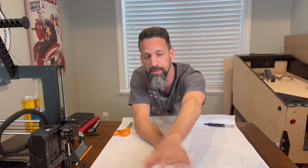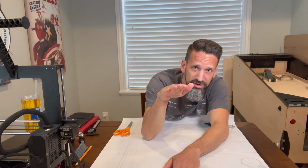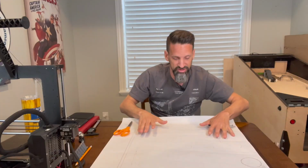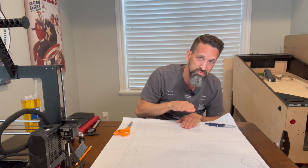The other good thing about that upper third is where you have the most height, right? You have the most clearance between the playfield and the glass, because it's slanted down. The closer you get to the front, there's less clearance. You only have about 3, maybe 3.5 inches of clearance above your flippers here, where in the back you have a good 6 to maybe even 7 inches of clearance.